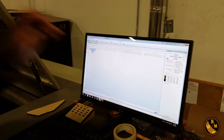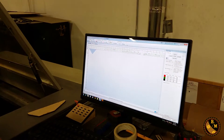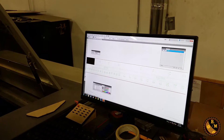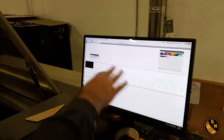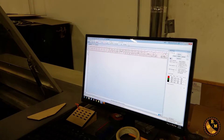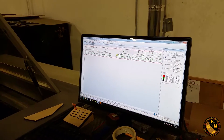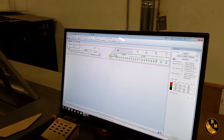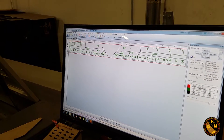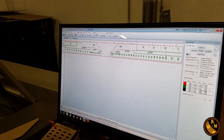You go to print, and it prints to the engraver program. This program is the actual engraver — it transfers all of the colors over. It uses RGB colors, so when setting up your Illustrator file, make sure you're using basic RGB for your swatches. Each color is going to be a different instruction for the laser cutter. I'm going to zoom in and set some passes to zero so I can ignore the black outlines.